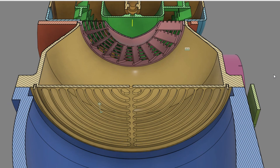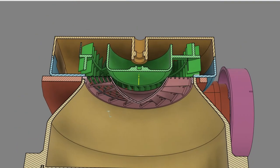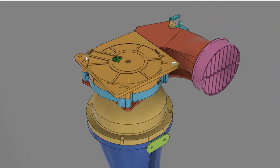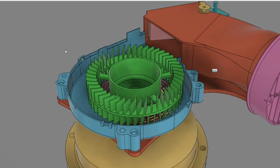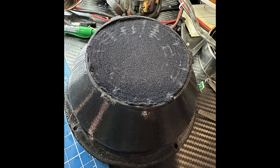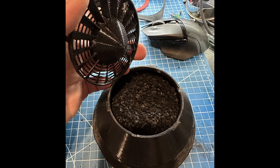On top of the two filter stages, I have a mount for a fan that attaches with a twist bayonet style fitting. I have a 120 millimeter blower fan or squirrel cage fan that was $20 from Amazon and it includes the speed controller and power supply. The beauty of this style fan is they can operate at a much higher pressure ratio than your typical 12 volt computer style axial fan. This fan can actually pull so much air that I had to create a vane diffuser at the top to help hold the charcoal in so it wouldn't get sucked through the fan. I also glued some women's nylon pantyhose onto this vane diffuser as well. Even with all this, I usually only use about half of the fan's maximum speed. The recommendation for hazardous chemicals is six to 12 air changes per hour, which equates to around 1.6 CFM for a two foot by two foot enclosure like mine. I'm going completely overkill with this fan that outputs 33 CFM unrestricted.